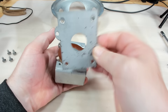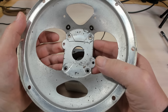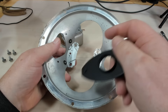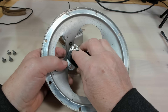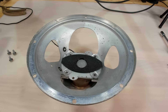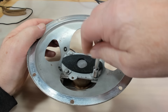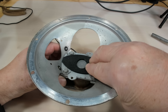I can put the coil back, turning it to get the wires lined up. Now this goes on here — the magnet needs to be centred inside this plate, and the basket needs to be centred on the plate. So as usual I printed up a 3D alignment tool. Pretty simple — two pins that fit into two holes in the basket to line it up, and a ring that fits in the gap. Now just a matter of putting the bolts in and this should all be lined up.